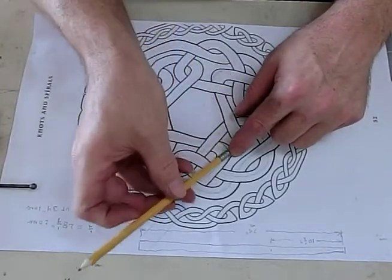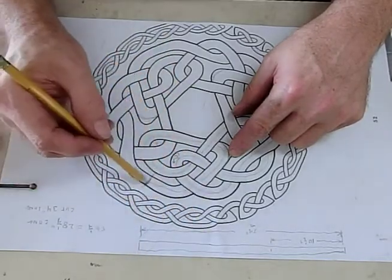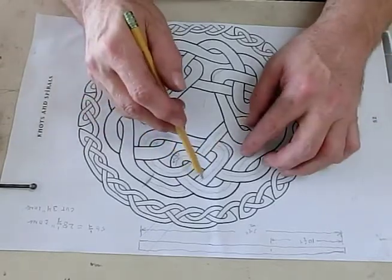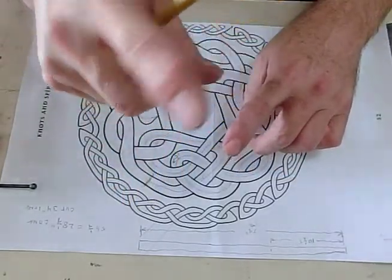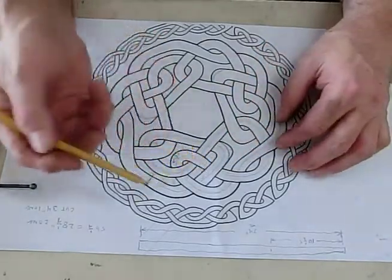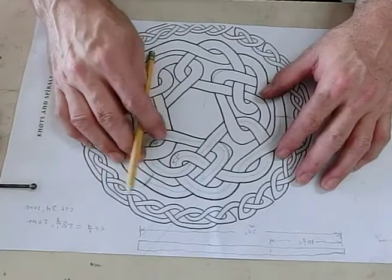Okay, and then we're gonna have to take that and twist it upward, and then bend it back around and go back down through here and out that way. And then we'll make this bend over to the end of our pattern. Hopefully that'll go that way. I've done similar things before, and I'll show you as I do it how I get that to weave in and out. It's just a matter of, you got this piece sticking up, you got to bend about halfway down again and curve it and bend the end curve and work it through there as you're heating it a little at a time with, in this case, scrolling tongs, because this is fairly small bar, only half inch by eighth of an inch. That's what we're going to deal with. So let me go cut the stock and we'll see what we can do to get started.